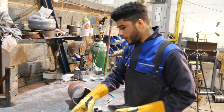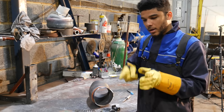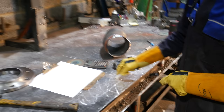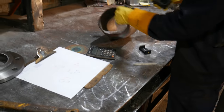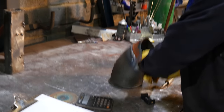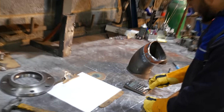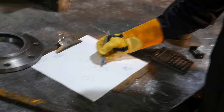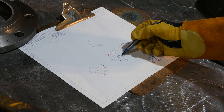I'm going to start off with finding out what half the diameter of this pipe is, so I know when I find my center mark I can put two marks either side of it and line up the pipe nicely within those two marks. This is 6 inch — 164 mil — so I do 164 divided by two: 82 mil. So I know once I find my center mark, I'll mark out 82 mil either side and I can fit it nicely in the middle.